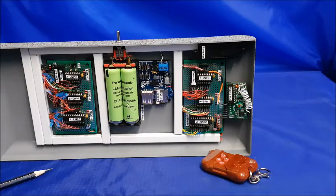The whole thing is based on very small microprocessors called PICAXE, and I'm using two different types, a 14M2 and a 20M2 processor. Not a lot of difference in them really, apart from the 20M2 having more outputs. Basically the 14M2 has 10 outputs and the 20M2 has 15 outputs. They also have inputs, and inputs and outputs can be mixed together. Some outputs are dedicated for pulse width modulation, for things like the beacons that you see pulsing and modulating.